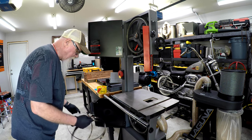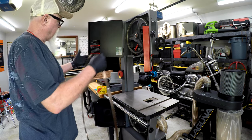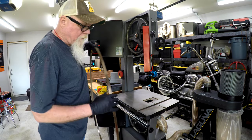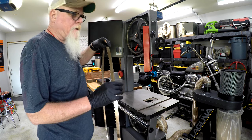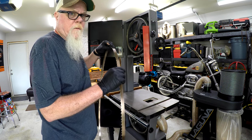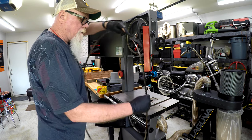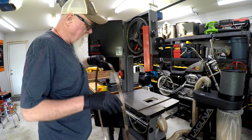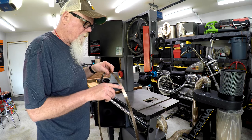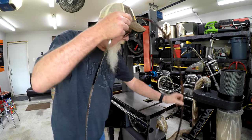This is a carbide tip blade. I already cut my gloves up on it there. You also want to make sure the teeth are pointing down — you can accidentally invert the blade when you stored it or put it away, and when you try to coil or uncoil it you can invert it so the teeth won't be right. Obviously we want the teeth pointed down. The cool thing is you could send this off and have it resharpened if it ever gets dull — it's pretty sharp still, not like it once was, but not too bad. Let's get this guy on here.